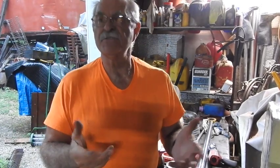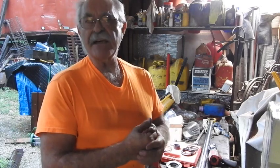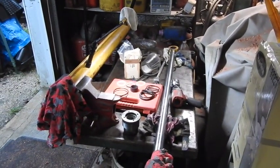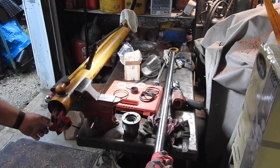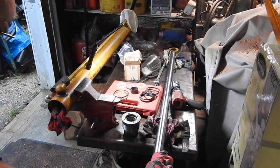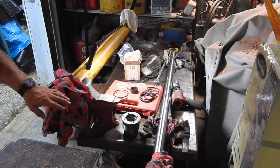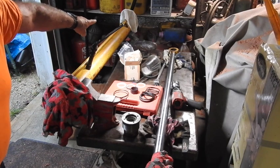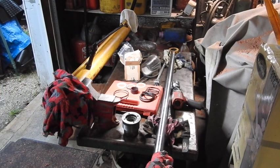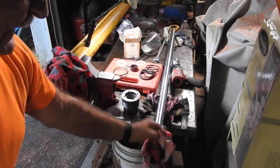You can tell by the backdrop that we've got a thunderstorm coming through — it's pretty noisy. But it's a perfect day to work on that cylinder. UPS delivered my repair kit last night, just about dark. So today's a good day — we'll see if we can go about the business of putting this thing back together. One of the main things you want to be concerned about with hydraulics is always cleanliness. I've got a rag stuffed in here to wick out any oil, then drop it into the sawdust. I keep the rag on the end just to make sure no dust gets pulled in. On the other end of the cylinder, the hydraulic fittings are covered with a rag as well, and even the old packing we're replacing is covered.